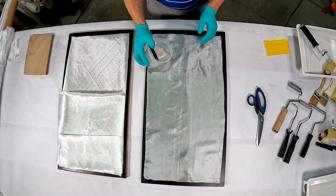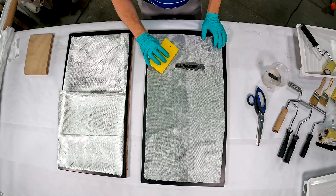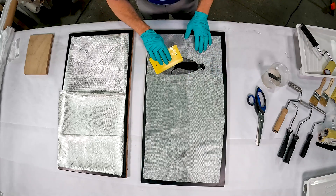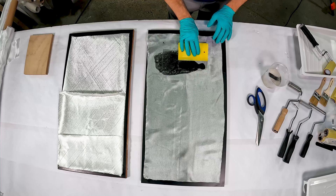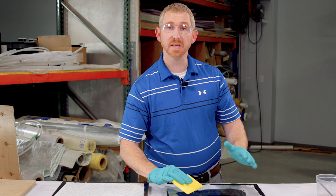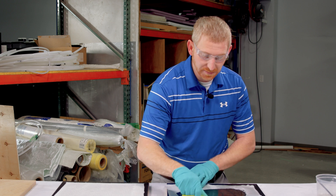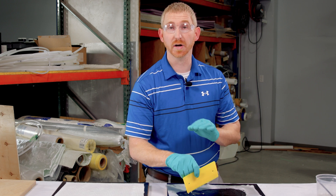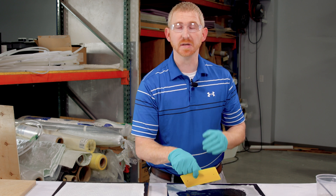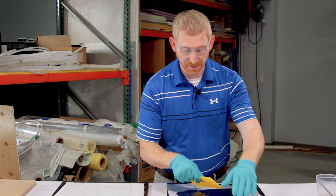I have 105 resin with 207 special clear hardener for clear finishing. I'll take a flexible plastic spreader and run it over the surface at a low angle to fully saturate the cloth, making sure the epoxy moves evenly — no shiny spots — so you actually see the weave of the fabric. Shiny spots mean the epoxy is too heavy and the glass may be lifting off the surface, which isn't ideal because you'd be hitting those high spots. You want to make sure the glass makes good contact with the surface.